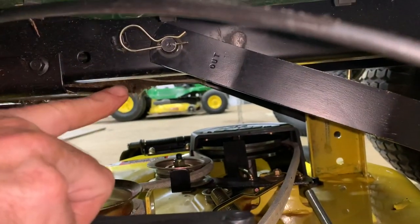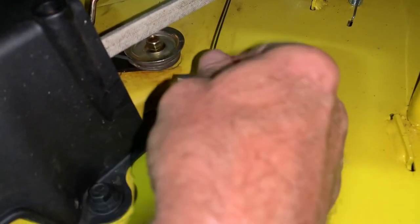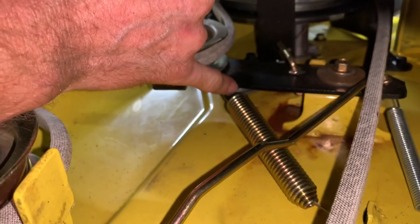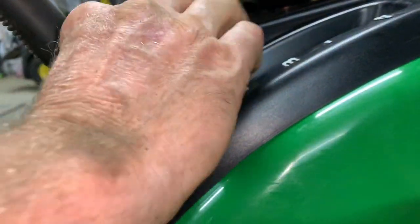Going to the back arm, but before we do that, we're actually going to take off the PTO cable. There's a pin here and these pins can be a little tricky to get off. Pull this out like that, then you can pull this right out and it comes out of its holster. You have to go underneath the belt here — underneath this bracket, this bar here is the blade brake. Make sure when you put this back that it goes underneath all this. Right here there's a little hook on the spring. If you go 90 degrees with this, you can get this off — come over here like this, 90 degrees, and it'll come right out. Put it somewhere where it won't get wrapped up underneath the wheels. I usually put a little bungee on these and wrap it around here, because these will come off and get wrapped up underneath your wheels when you're driving without the mower deck on.